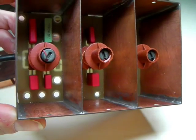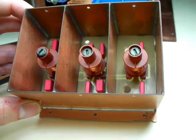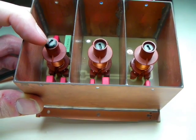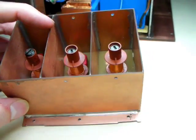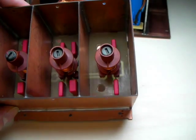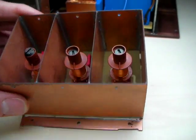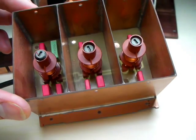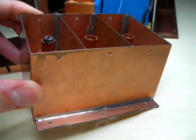You can see three little chambers here, each containing a coil and some capacitors — that's the Pi harmonic filter. The first part matches the impedance of the output amplifier from 4 ohm to 50 ohm. The second and third sections are Pi filters for harmonic suppression. The boxes are homemade, just cut and soldered together from pieces of copper board.